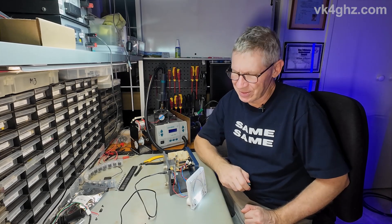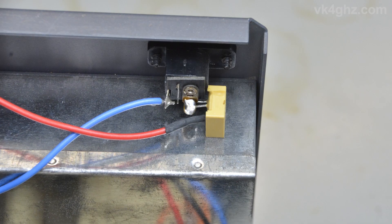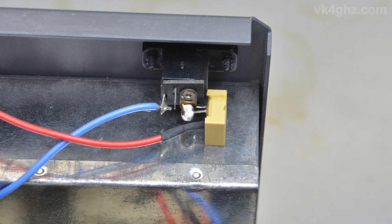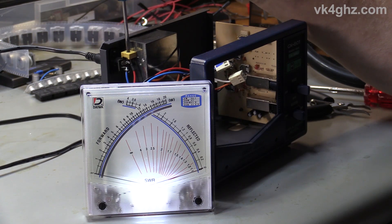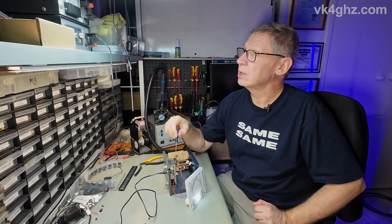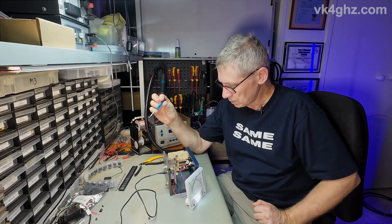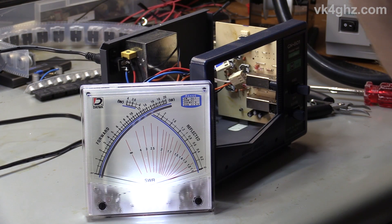It's the following day and I thought it was a little bit too bright, so I've added a 100-ohm trim pot up the top. The wiper is soldered directly to the DC coaxial connector and one side of the trim pot is soldered to the red wire, which goes off to the 100-ohm fixed-value resistor. It provides a useful dimming range — I'll probably keep it all the way at the end. The trim pot is 100 ohms but you could do 100, 200, or 500. At the lowest brightness level we're only drawing 12 milliamps, so that current isn't a problem for these trim pots. The dust was also bothering me so I've gotten in there and carefully wiped it down. It's ready to reassemble.